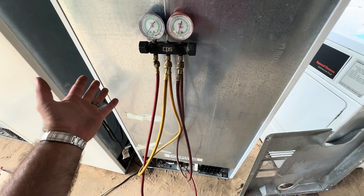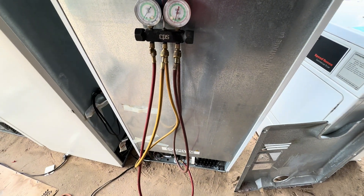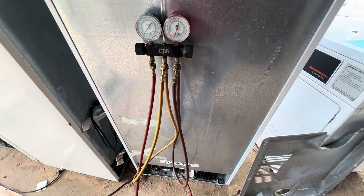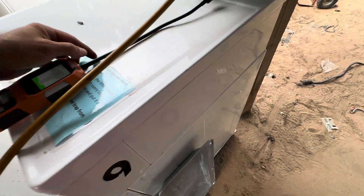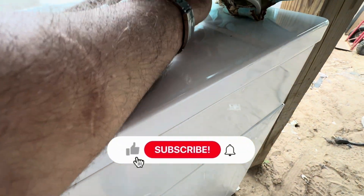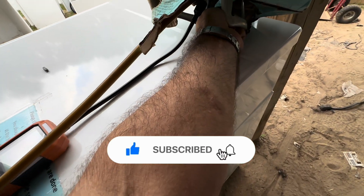It's in a vacuum — there is no freon in here. It ain't gonna smell it if it ain't got no freon. So what should we do? Maybe put a little bit in there and see what it does. I've got our sniffer on there — I'm going to put it right up where the nozzle is and let's see what happens.